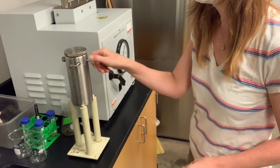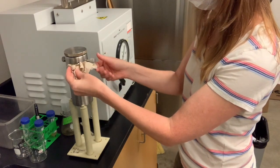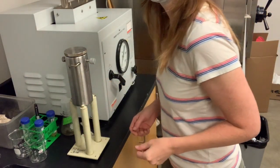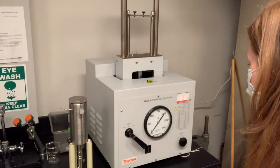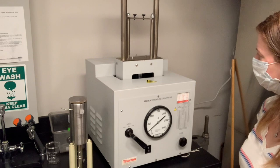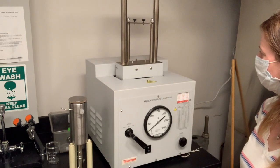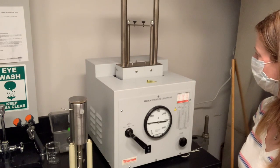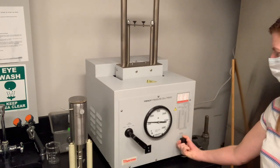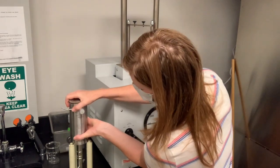Now screw the valve stem all the way in until it's tight — not over-tight, because that could cause the fresh ball bearing to get smooshed again — but closed enough that material won't squirt out. Now we're ready to turn the machine on. There's a toggle switch in the front — pop that up. The platen or platform that holds the cell will descend as long as the lever is pointed all the way to the left in the down position. When it gets to the bottom of its trajectory, you'll see the front gauge pop up to 500. You can change this setting with the pressure increase knob, but 500 has been found to be really good for popping open cells, so we leave it there.